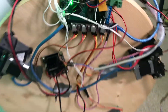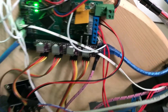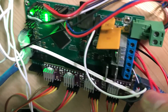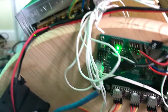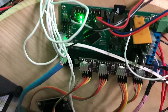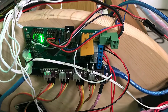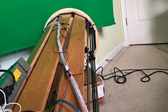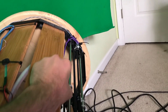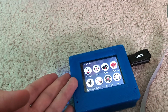There are four motor drivers here. Three of them connect to the movement motors and the fourth connects to the extruder motor. It also has heater plugs that connect to the heater on the hot end side, which melts the plastic, and it controls whether or not the hot bed is on or off. It also takes in temperature sensing leads, which give it the temperatures on the heat bed and the hot end so it can keep from burning the house down. Wires come in from switches at the top so it can sense when the carriages have hit the top. Outside of all this, I have this little computer here, which does the job of sending all the print commands to the printer.